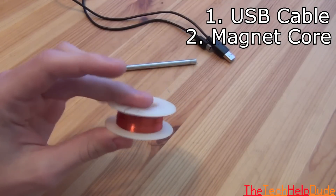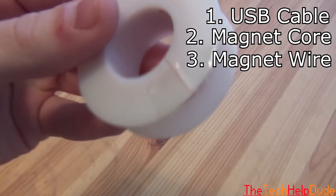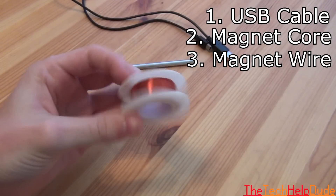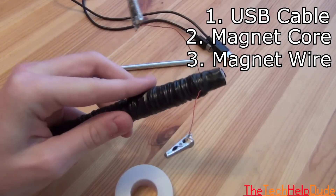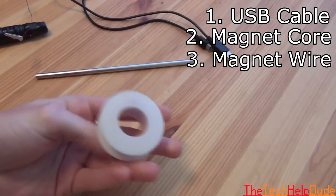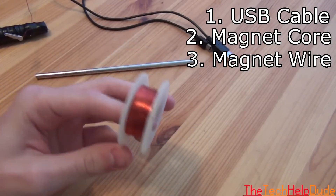The last thing you're going to need is a certain gauge copper magnet wire. This wire is really thin — about 32 gauge. The wire I used to make this magnet is a little thicker, about 24 gauge. Anywhere between 20 and 30 is usually going to be good for this. I would recommend getting a length of at least 100 feet — obviously more the merrier. The longer your wire, the more turns on the magnet, and the more powerful the magnet is.